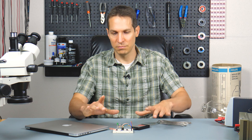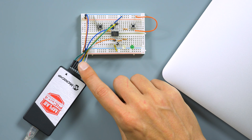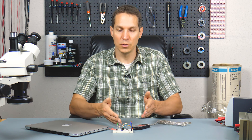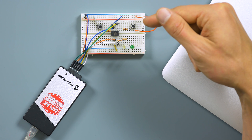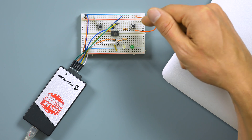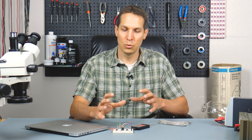Right now I have the first circuit that we're going to use already set up. You can see the things we're going to need: some jumper cables — male to male and male to female, depending on which tutorial we're on. Right now I'm only using male to male, but eventually we'll need male to female. We have some 1K and 10K resistors for our LEDs and to protect the microcontroller with the switches. We have some push button switches, and we'll eventually need a piezoelectric buzzer. Once you have those things, you should be good to go.